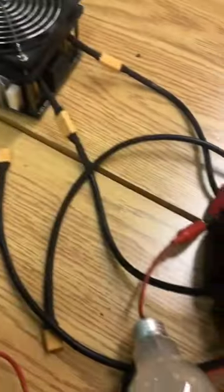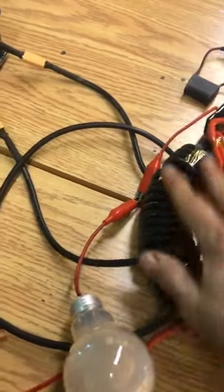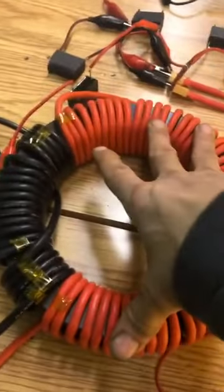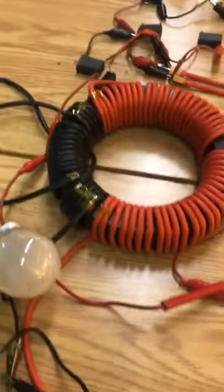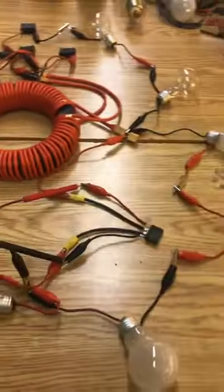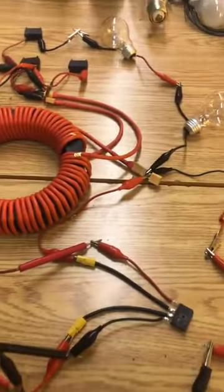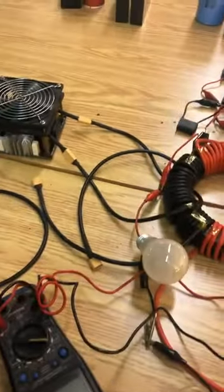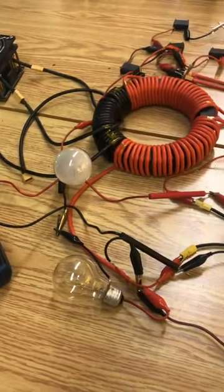We initialize it with the ZVS — that's the finalized design — and then we harvest it either on this coil or whatever coils are wound in and about that core. The magnetic field is transferring electric to magnetic and back in oscillation in a figure eight, at whatever frequency we've locked the device at, chosen by the resistance of the resonator and the fundamental frequency of the ZVS.